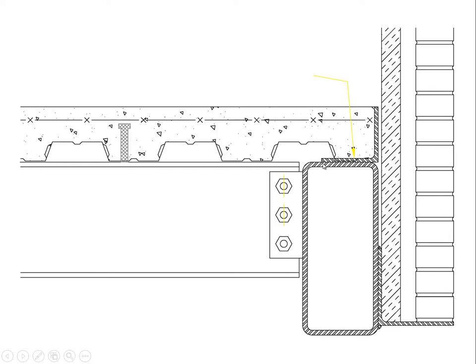If we put an I-beam right here as our girder or our spandrel beam, that I-beam is going to be very adversely affected. And the reason is that out here we have a huge amount of weight associated with the brick, and that brick is very substantially offset from the center line of this beam. So somewhere in the background, this beam is connected to a column. That column is tending to support the beam along the center line of the beam.